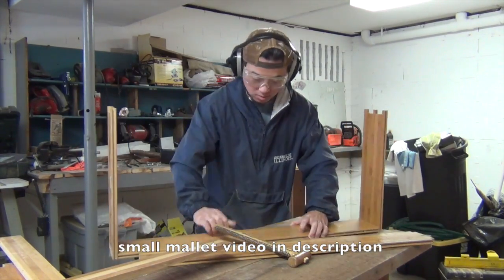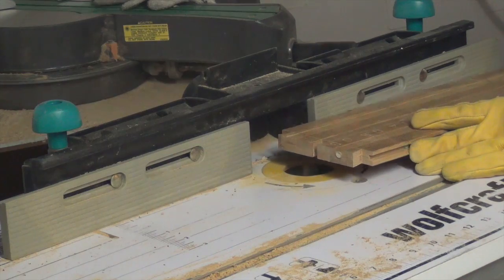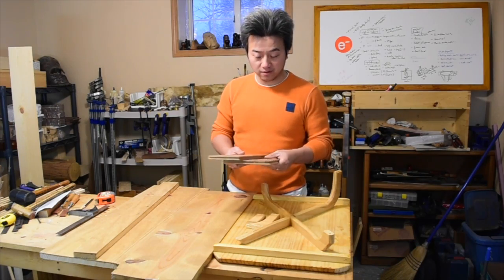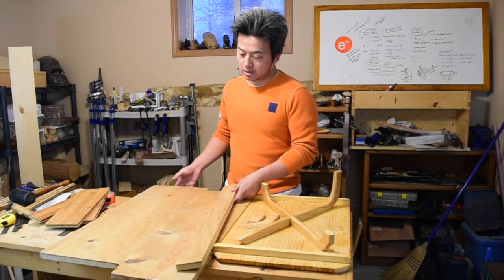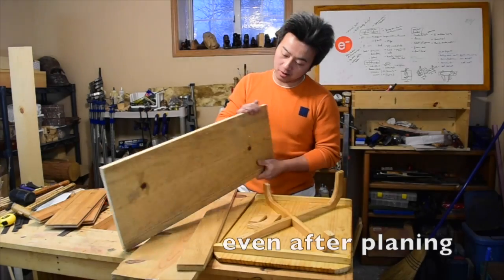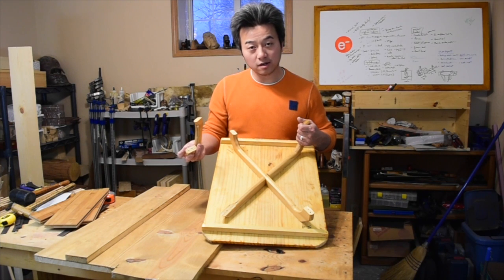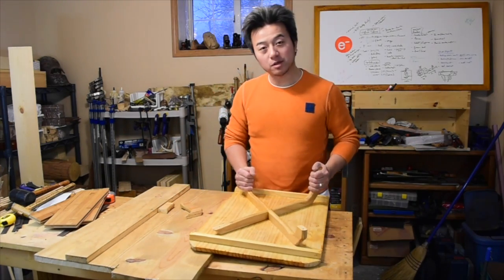One of the last things I still need to do is cut the housing for the dados from the bottom. The side with the pins can go straight through; for the side with the tails, I'll have to do a little plunge routing. I ran into a problem — these three pieces of bamboo are the biggest pieces I have left and that's not going to be enough to cover the bottom. When we remodeled and put down the bamboo floors, I took out a lot of old shelving from the closet, leaving me some pine boards stained on one side to use as the bottom.